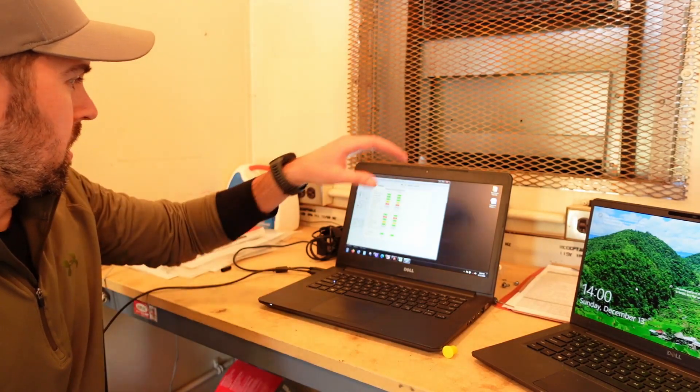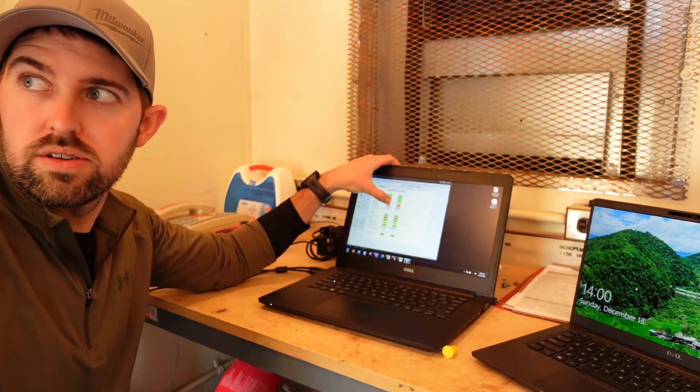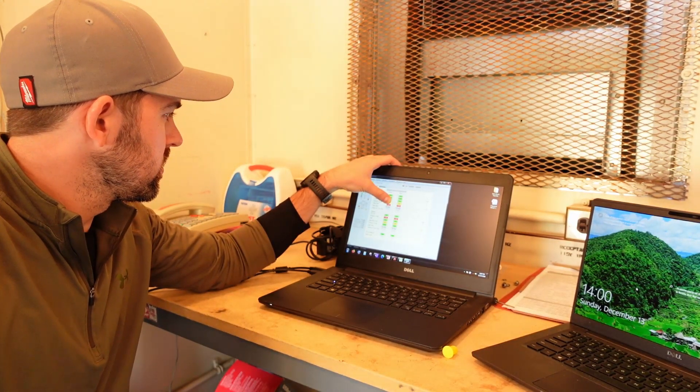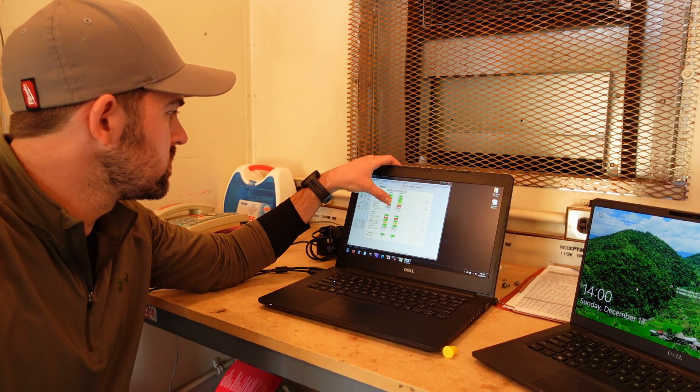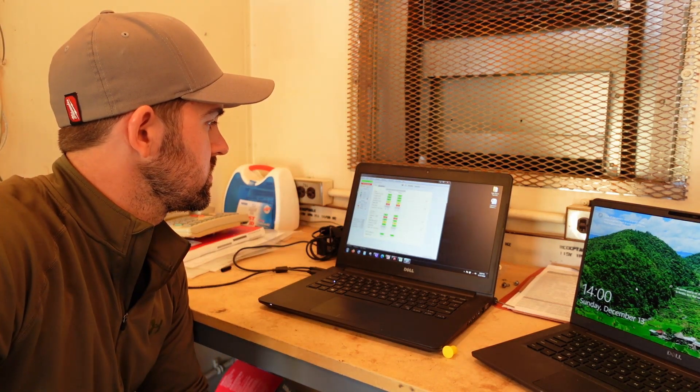Another way to think about this is cutting the cables is kind of a rough-in way to phase it initially, and then the fine-tuning for the phase is given to you by the C2 adjustment in the MRU. The technician behind me is adjusting the course SBO phase on the C2 on the MRU, and he's walking it down from 14 of the 150 to a 9 — 7, 5, 2, 1 — and that will be just fine for us.